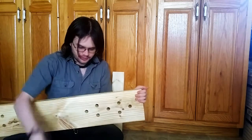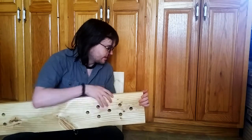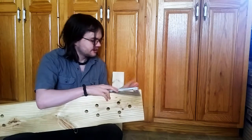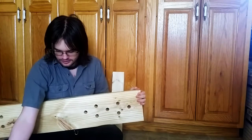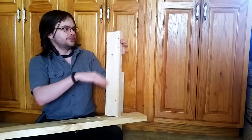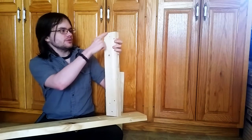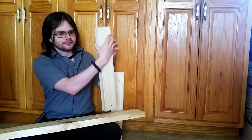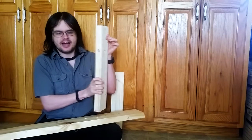To minimize the amount of work I have to do as far as planing in green, I've already identified that this one is the smallest of those. Let's see how big that is - one and an eighth. So that means I'm going to have this resting on the joinery, just kind of held together with the fastener. I'm going to have to come down one and an eighth and make a little shelf there, and then take it in a little bit on one side so that it can resist racking a little better.